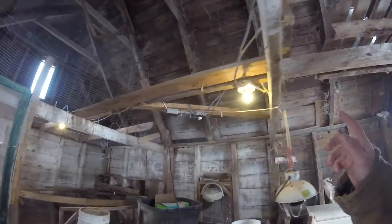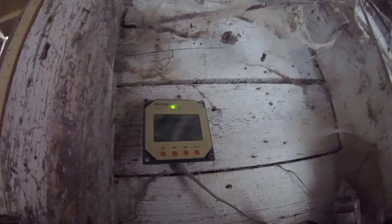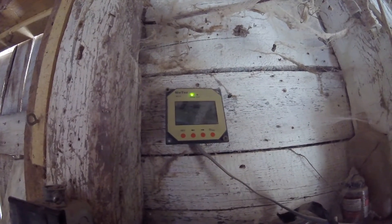Very, very little draw. They may or may not be as bright as the 120 volt bulbs, but two of them in there should be plenty. It makes the barn safer — a kid sticking a finger in the wiring isn't going to hurt themselves. It also means much better longevity for the battery and solar power system. The previous lights were drawing about 1.1 amps, so these are drawing not quite half that, though I will lose some luminosity.